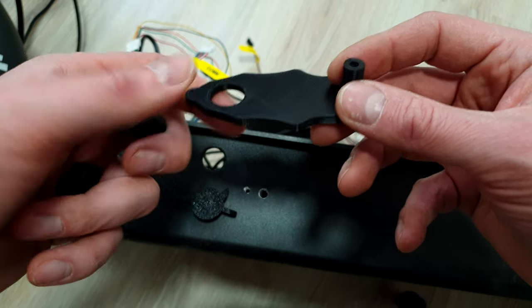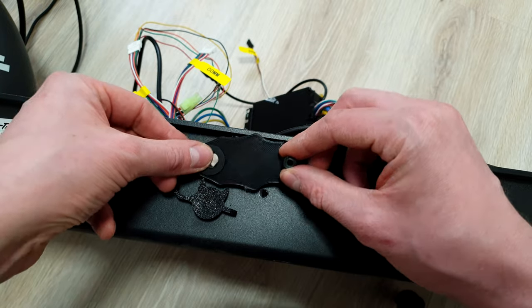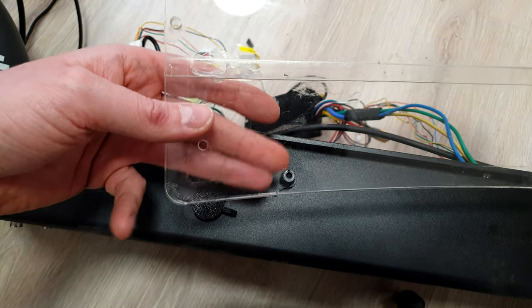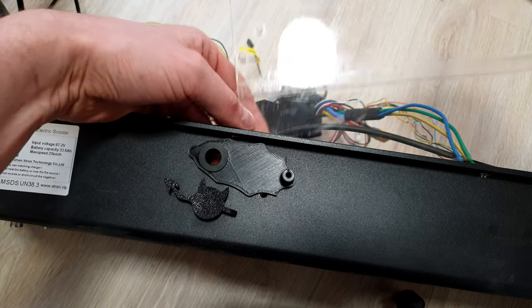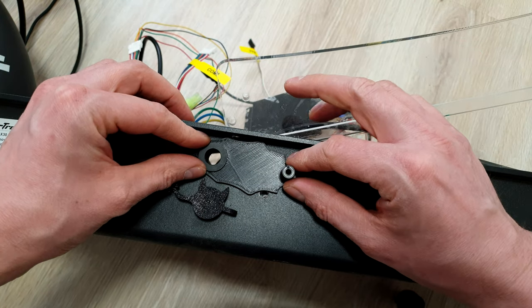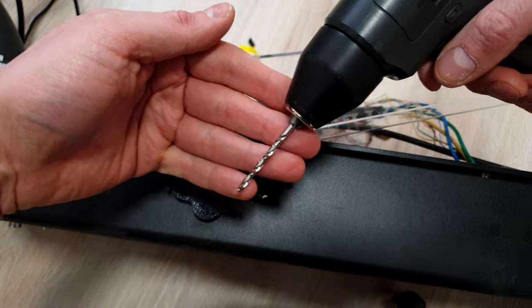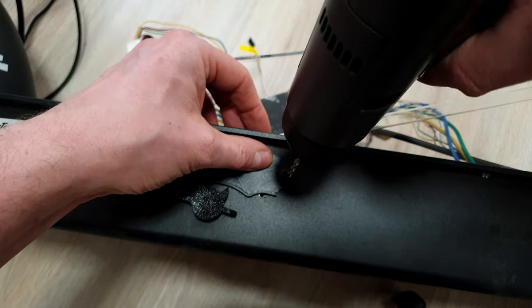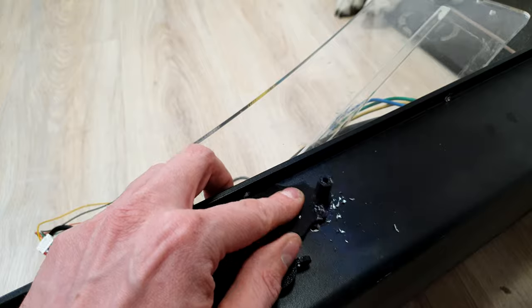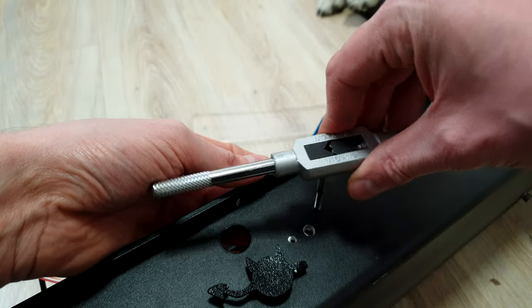To mount the loop key, I use this extra adapter — placing it into the hole of the charging port and tightening it with this nut. You have to place something between the battery and the hole you will drill, so I use this plexiglass, because if the drill hits the battery you will get a big short circuit. I use a 3.5mm drill bit to make the hole, then use a threading tool to make a thread in the hole. If you don't have one you can use a simple M4 screw.